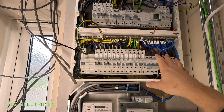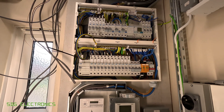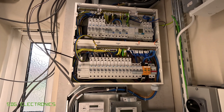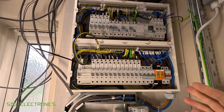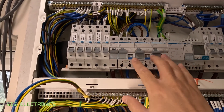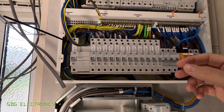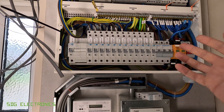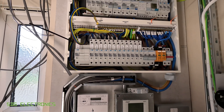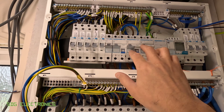When I was installing all of the stuff in this board, I actually ended up with quite a bit less space in the consumer unit than I'd originally anticipated because I decided to install some arc fault detection devices. That's these three units here, and at the time — about eight months ago when I bought most of the equipment — Hager's offering of arc fault detection devices was pretty limited, and what we've got here are these double width units, three of them here.